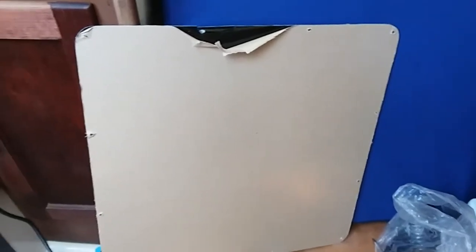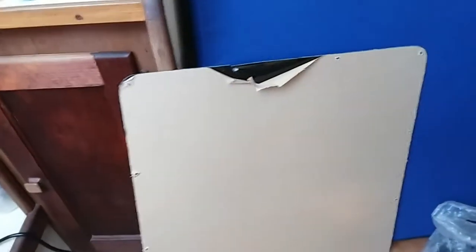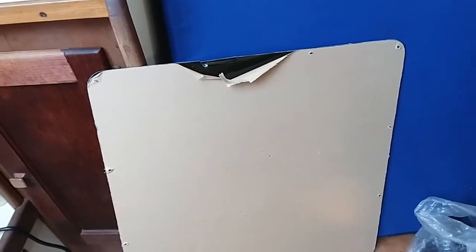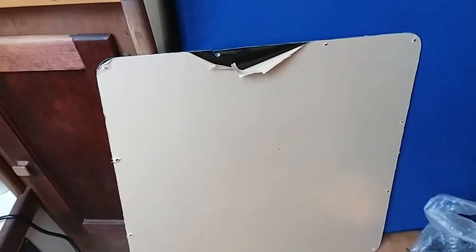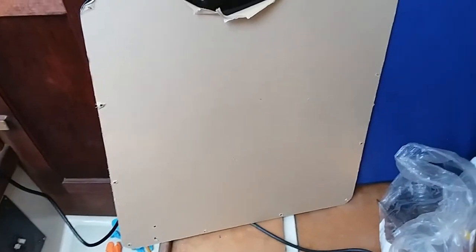Doing multiple drill bits, so I went to 5/32 and then 7/32, and that helped to get through the holes, but it just really bites into the acrylic and drags the bit through, and that's what makes it want to crack. So we'll have to be more careful next time.